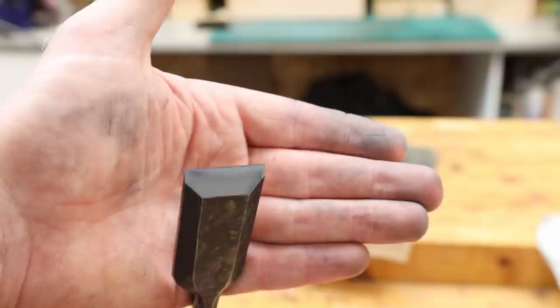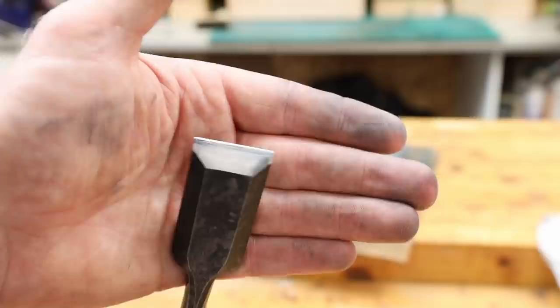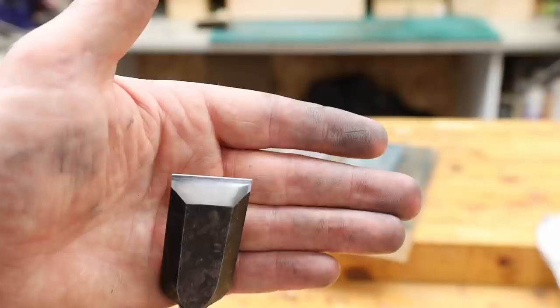Finishing up — I've put a nice polished edge on it. I kind of naturally put a secondary bevel in this blade; it just happened from muscle memory sharpening my other chisels. We'll run with that. Here's a quick close-up — you can see the hardened steel shining there, that's the polished edge. The softer steel above it is a duller color. A secondary bevel went in but we'll test this out now and see how good it is.